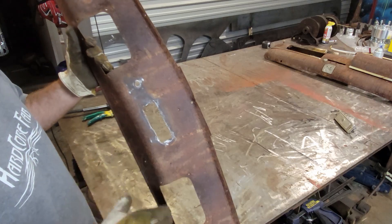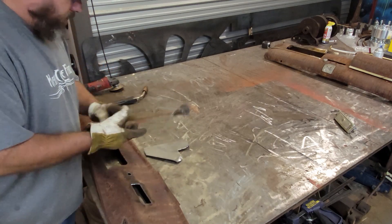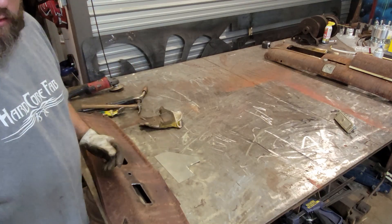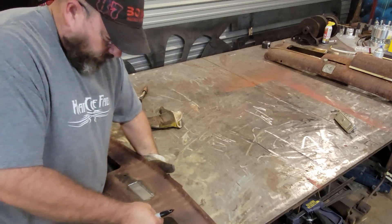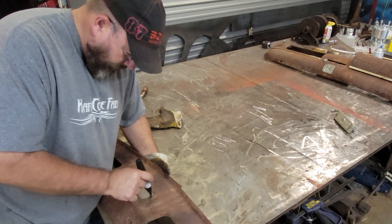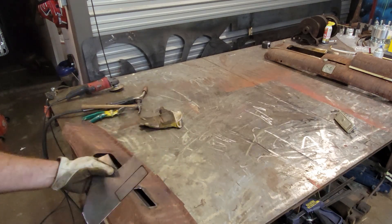It's not perfectly square, but it's definitely good enough to make a patch panel now — way easier than what we had before. I've got a piece of scrap from the floor by my shear. We need to flatten that out a bit, make it good enough to sit underneath the panel and trace it out. That's about as straightforward as it sounds — slide it right underneath there and line up a couple of edges so I have less to cut.